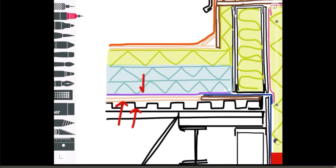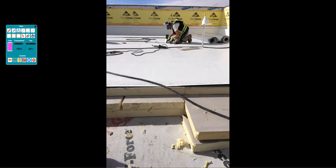I've done a conventional roof system here where the roof membrane is exposed on top. The purple line represents the air and vapor barrier. It's good practice to put that on a sheathing board so you have a nice flat surface for it to sit on. I've seen cases where the board isn't there and the membrane can get holes in it as you're working on the roof. Putting the board down is certainly good practice but not 100% required. The insulation shown here is poly iso insulation — a very typical conventional roof assembly, with the air and vapor barrier on top of a sheathing board.